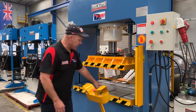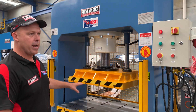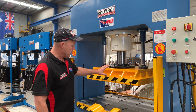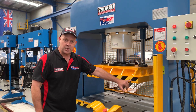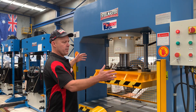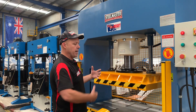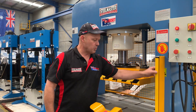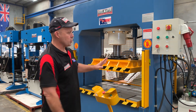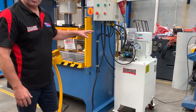We've got a large bed area here, as you can see. This particular 160 tonne press has roughly a one metre by 700mm bottom platen size. We've also got the top platen, and as you can see that's all T-slotted. Heavy duty single ram with two side guides. It's a straight sided press, so you've got access front and back. This also has the optional front laser guards for safety. We've got the foot pedal control, which we'll run through shortly, and over there we've got the hydraulic power pack with variable hydraulic pressure control.